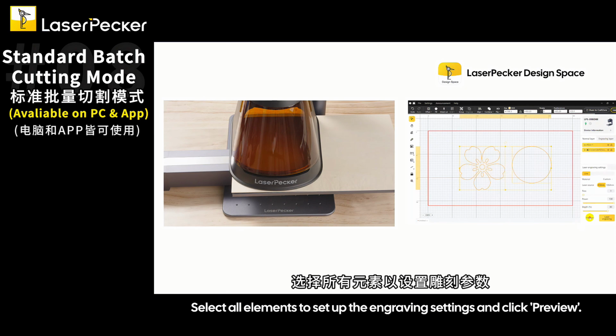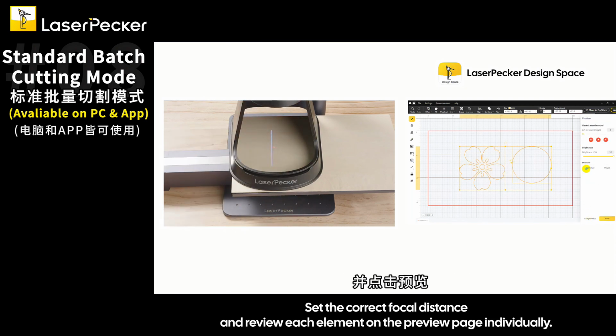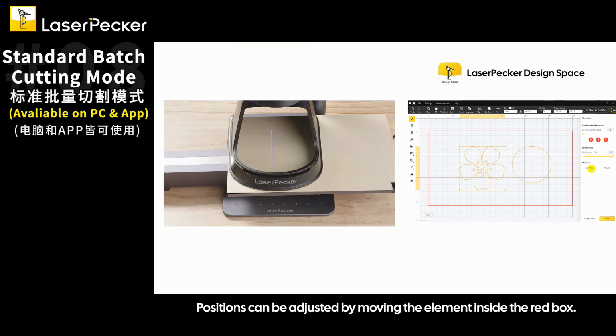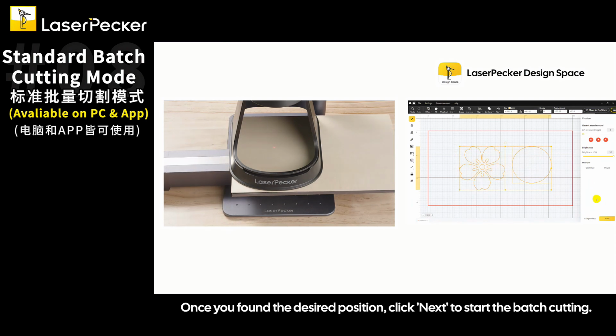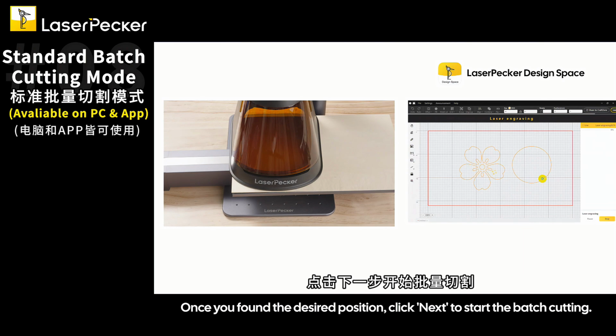Select all elements to set up the engraving settings and click Preview. Set the correct focal distance and review each element on the preview page individually. Positions can be adjusted by moving the element inside the red box. Once you've found the desired position, click Next to start the batch cutting.